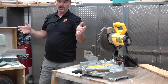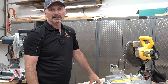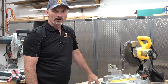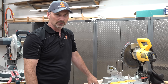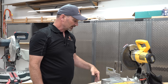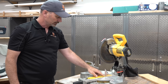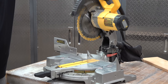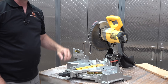If you're running these saws on extension cords, it's a really good idea to use at least a 12-gauge cord — not your regular 16 or 14 gauge. 12 gauge would be great, especially if you're having to run the cord more than 20 feet or so. It's good to have a heavier cord because these motors take some juice. On this saw, the yellow area is a danger zone — keep your hand out of there. When that blade comes down it goes into that groove in the middle, so if you stay out of the yellow zone, you're about an inch away from the blade.